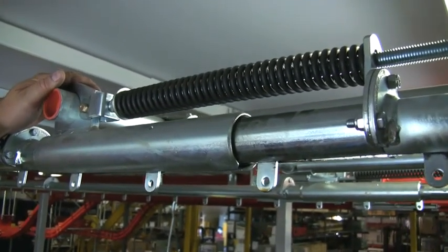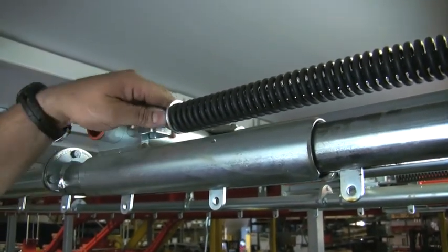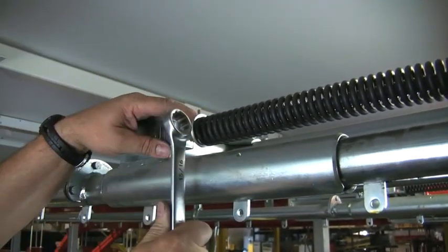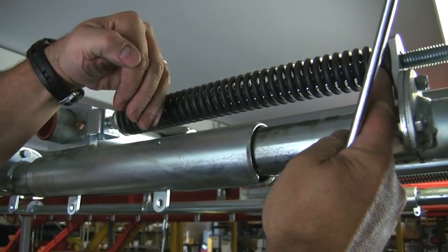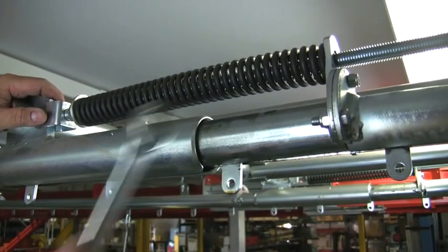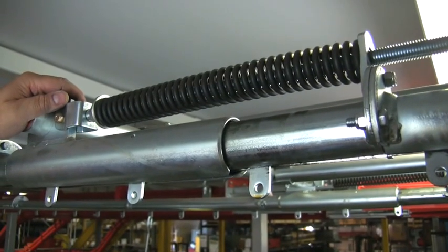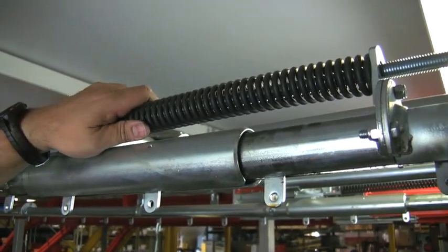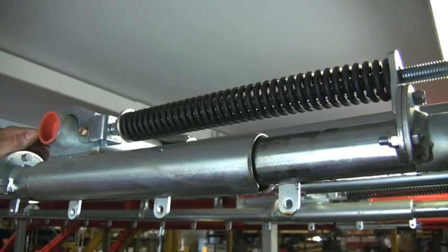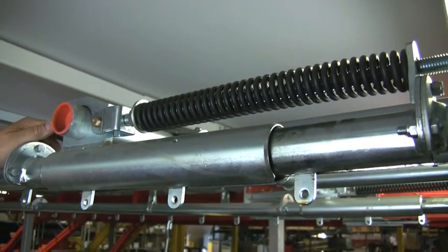This system is relatively new. The nut on this side of the spring is used to tension the spring — if I tighten this up, it will cause this side of the spring to be compressed, putting more force on the 180-degree curve and causing the chain to be pulled out tighter. In some instances this can cause adverse effects. Too tight means you're adding chain tension where you didn't need to, which may cause wear on your chain or make the drive unit excessively loaded so it'll slow down.